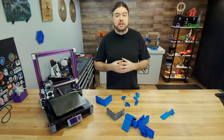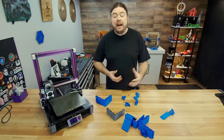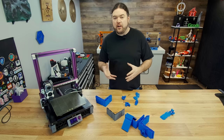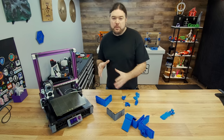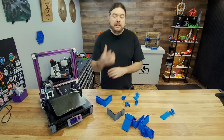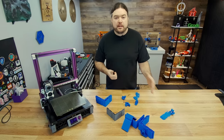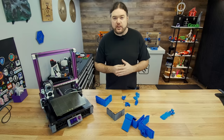That was just a little bit of fun showing you the failures I had while dialing in Input Shaper. I took the printer just a little bit too far as far as acceleration goes. And again, this is a moving bed — it's an i3 style here on the Voron Switchwire — so probably not the best machine to try to crank up the acceleration on. But I do think it's interesting to try to dial one of these in using this feature.